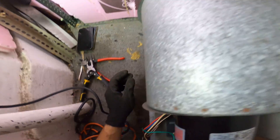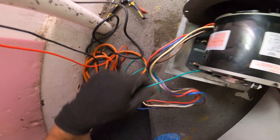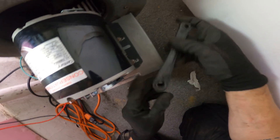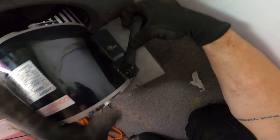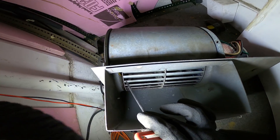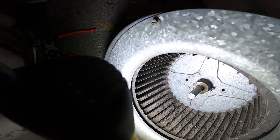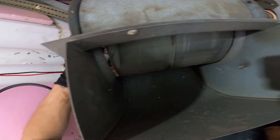Oh my god, this just fit! Alright, I got this centered. I'm just going to snug it down and then adjust our fan blade to see if we're good. We're going to take our blade and balance it between this edge and this edge and lock down our screw. One thing to point out is that this locking screw should be on the flat side of the shaft.